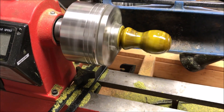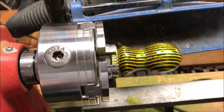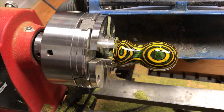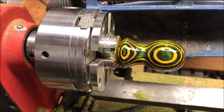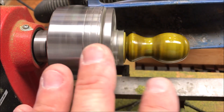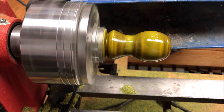Let me show you guys what I've been working on — this is the handle for my lathe. I think it's turning out really nice; it looks really, really cool and it's ready to go. There's already a hole in the end of it that I can epoxy the insert I made into. I just need to finish the CA, buff it out with some micro mesh, part it off, and epoxy it in.